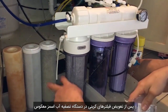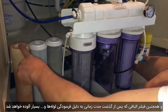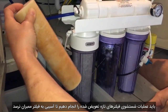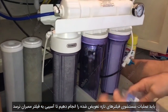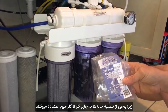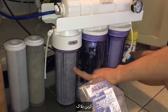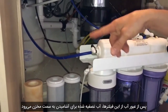I've always run dual carbons in my RO system. First is the sediment filter — as you can see it gets pretty dirty; we have old pipes in our neighborhood so it catches a lot of the rust and deposits. From there I've always run dual carbons before going into the membrane. I just switched over to a chloramine blaster because some municipalities have been switching over to chloramines instead of chlorine, so I'm using one of these inline as well. I'm going sediment, chloramine, carbon block, then membrane, then it tees off to a storage tank back there for drinking purposes.